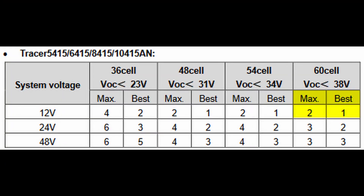Have you seen this to be the case? It's interesting and it triggers more questions. I'm very curious now to measure the efficiency curves of different charge controllers, since the ones I use don't typically publish that data. Interestingly, when you bring up the EPEVER manual itself, it states that the maximum number of 60-cell panels in series is two, but the recommended best is one — which would indicate parallel is best. And yet, series works better. As things typically go, I answered one question and now I've got three more.